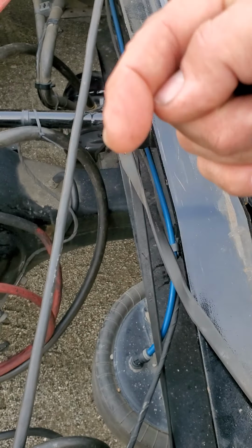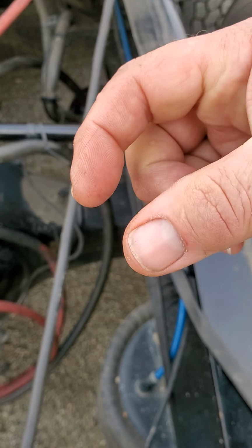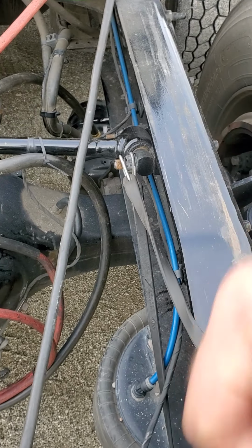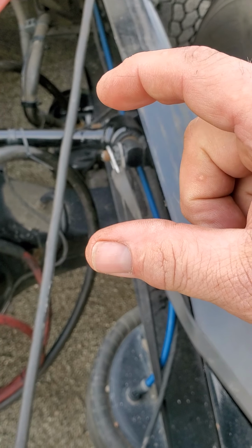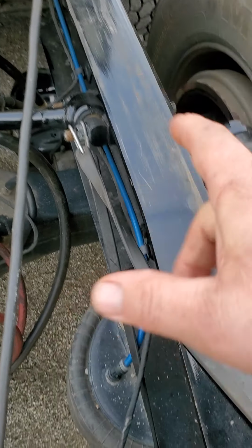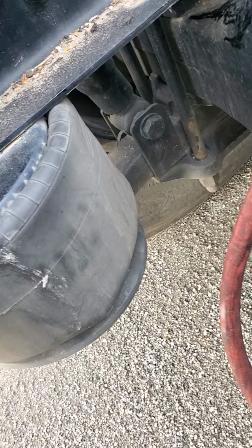So when that bolt slides all the way in there, and then you put your washer and your nut on there, it's like you're tightening it down. When you're tightening it, the spring is like this, and as you tighten it, the spring closes, which actually opens the brake shoe on the drum. So I barely am touching down there. So I'm gonna have brakes.